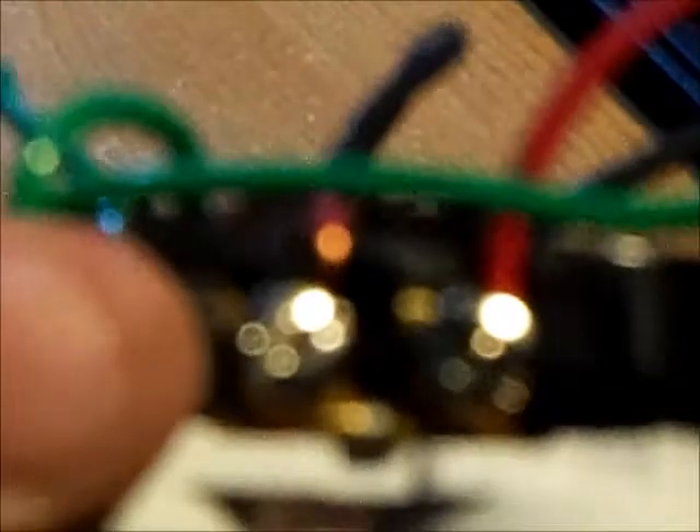That failed because of way too many amps going through it, and that is what burned out. I'm going to wire this correctly according to the electrician I spoke with and show you the way it should be wired — if you wire it that way, you will not have your outlets burn out like in my previous video. Also, don't ever use these little holes right here to shove a wire into. That's not a good connection; that's another spot where they can arc out. You can see where I cut the wire off on that one — that's an open invitation to arcing out.